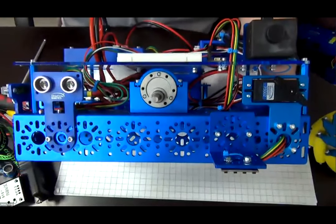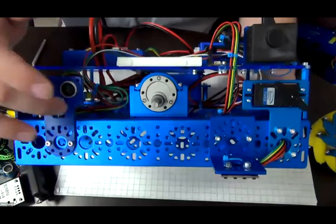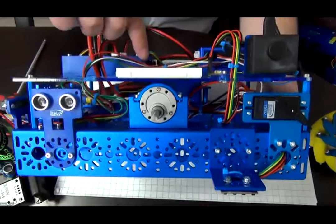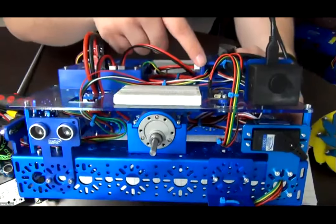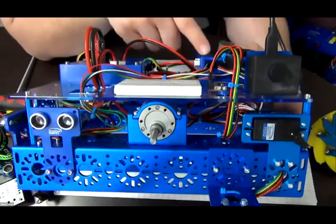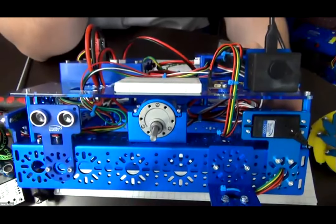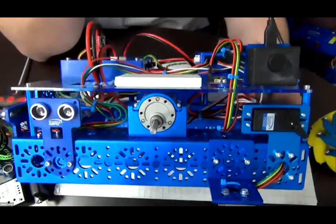Okay. So here we have the ping, the ultrasonic sensor. You can sort of see here at the back, we have the cables that are then flowing through up into the port here, which is the flex DIO port on the VMX. The reason why we use the flex DIO port for the ultrasonic sensor is that we are doing an in and out communication. So we need to be able to send and receive back data.